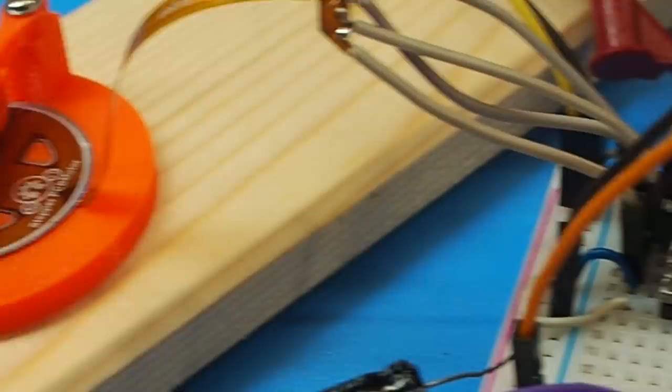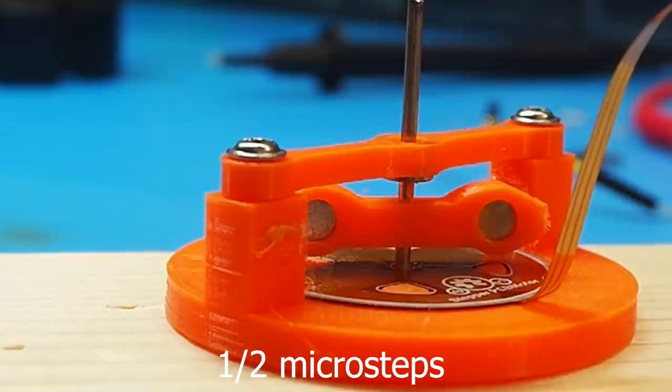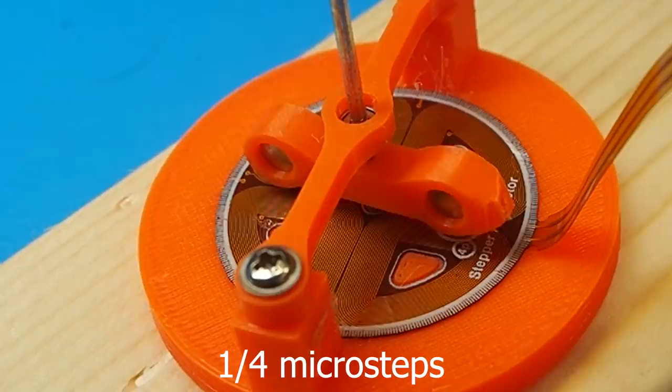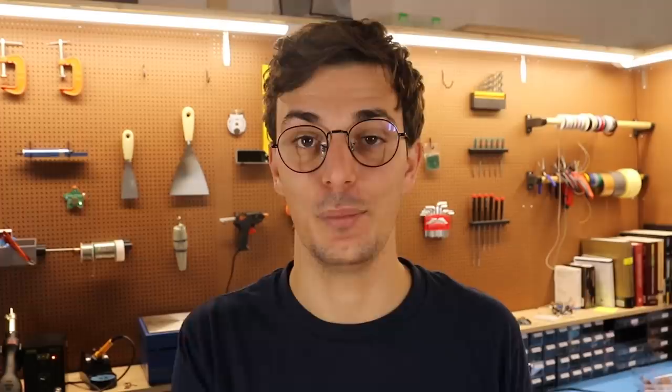As a last test I decided to try the lower microstepping settings with the Pololu driver. Half stepping worked but made the rotor shaky and unstable. The last option was 1/4 stepping, which still skipped some steps. Anyway, I learned a lot from this project and would definitely love to do a second prototype — maybe not a flexible one this time. I have several ideas on how this can be improved, and I'd also like to test an 8-pole version which should give better angular resolution. If you're interested, I've linked all the open source files. Next week I'll also be having a PCB giveaway on my Patreon. See you in the next video.